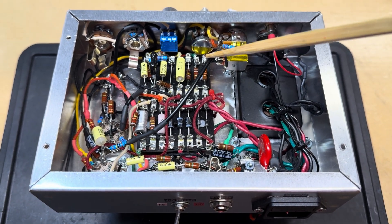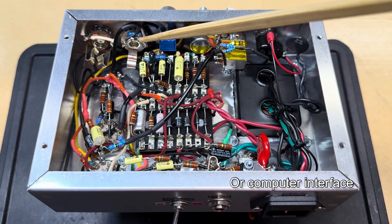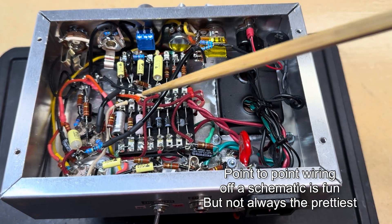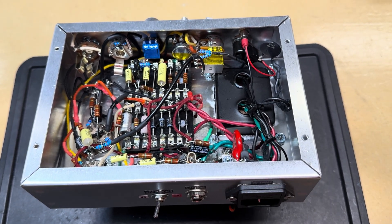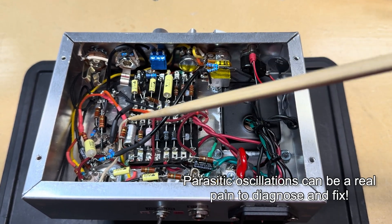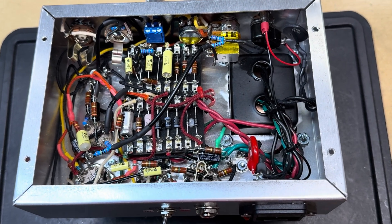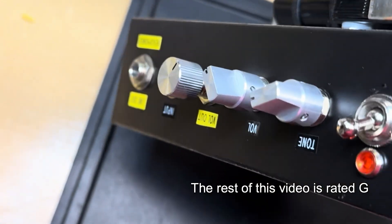Once the amp is in the little cabinet with a six-inch speaker, there's a volume control, a control for line out or headphones, the guitar input, and headphone output. During the build and testing I found that because everything's so physically close together, it was impossible to do really good lead dress, and I had to put in shielded wire for feeding the grids on the 12AX7s because I was getting oscillation issues — that was the easy fix.